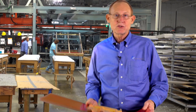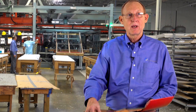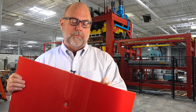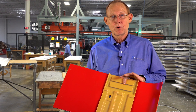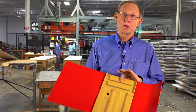So Bob, how many of your competitors have zero sag machines? Very few — probably less than your hands and toes combined in all of North America. So you mentioned twin sheet — isn't that where you put two pieces of plastic together in one operation? This is a twin sheet part. We form two pieces of plastic at the same time, get them hot, bring them together, and it's a homogeneous bond — inseparable. The molecular structure is as if it was one solid sheet of material. The beauty of this process is we can cut the material footprint by as much as a third, using two thinner sheets to form a single part to reduce material use and save money.